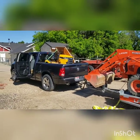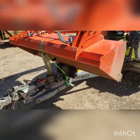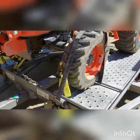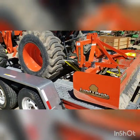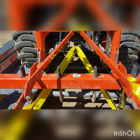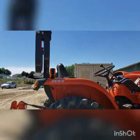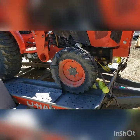I'll bring it back for one more video once I've got it all ratcheted down. Just finished loading up the tractor. Got some one-inch straps holding it down there, it's all chained up as well as some straps. I had some wire to wrap them up so they're not flopping around and unraveling — I wish I had electrical tape, that would really lock them down. I ended up securing on this back part of the tractor. Did a four-point attachment and dropped the ROPS bars up there — no need to have that extra clearance if I'm going under something. So it should be all locked down and we'll hit the road and see how it does.